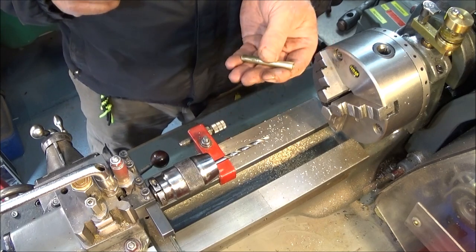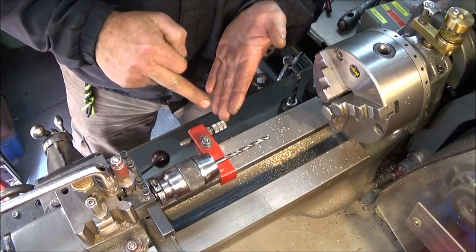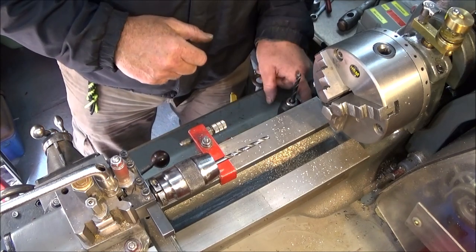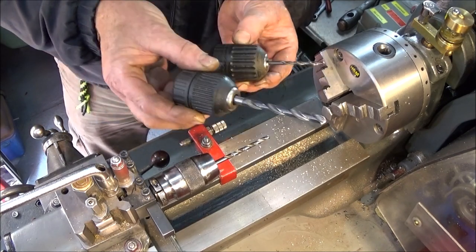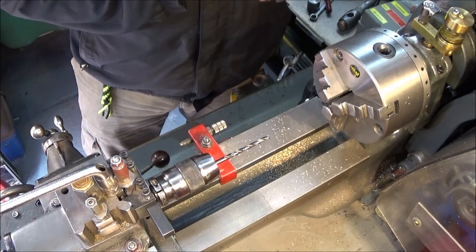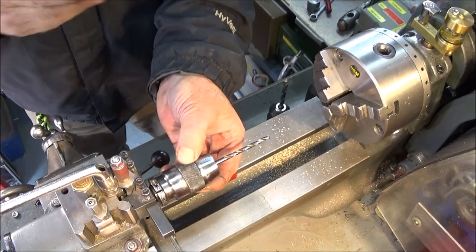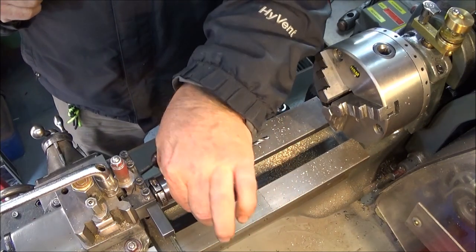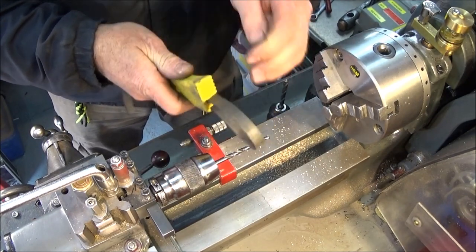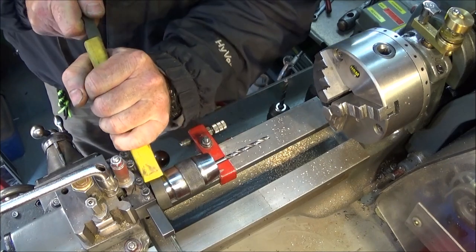And that's the basics of batch work on the lathe. If you've got a lathe with a multi-position saddle stop — one that you can turn — you've got various lengths set on there. You can have tools preset in other chucks, just change the chuck and use in conjunction with the particular saddle stop. And if the chuck gets slightly stuck on there after drilling when using the multiple stop method, you simply get one of these strap wrenches and that will undo it easily.